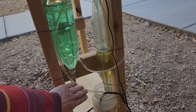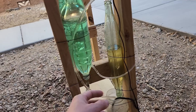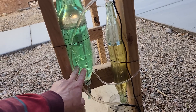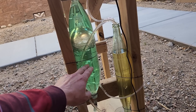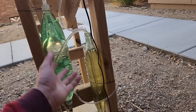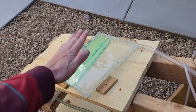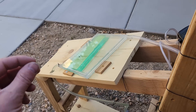Now you may notice that I'm using brine. Why would I be using brine over here? Well, brine won't freeze — it's an antifreeze and it's non-toxic. Now on the full version, this actually goes through a stainless steel coil inside of the algae tank, and that will absorb heat from the algae. Then it will go into a radiator and a fan to expel the heat out into the atmosphere, or out into space. This is because when this is operating, the sunlight is shining on the algae, and the heat produced by the sun could eventually cook the algae alive. So this gets rid of the heat.